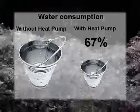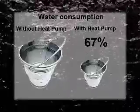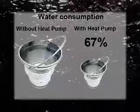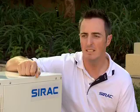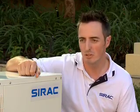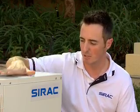A standard 200 litre geyser uses roughly 10 kilowatts of electricity to heat the water. A heat pump will use a quarter of that to achieve the same amount of heating. The way it does that is by absorbing heat energy out of the air — just like a solar panel would, except we're taking the heat out of the air, not out of the sunlight. It absorbs that heat and converts it to a usable temperature through compression in the machine itself, then puts that energy into your water.